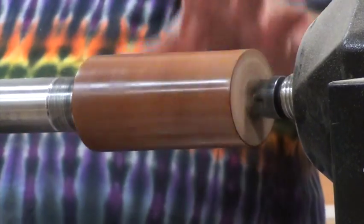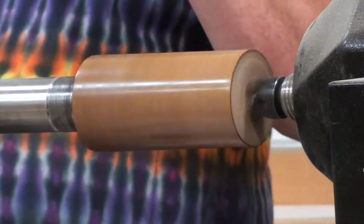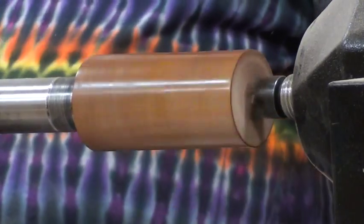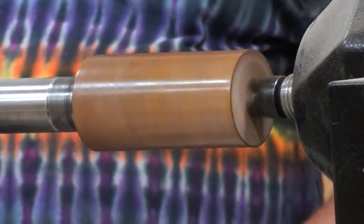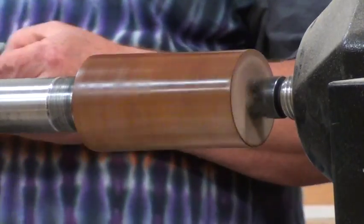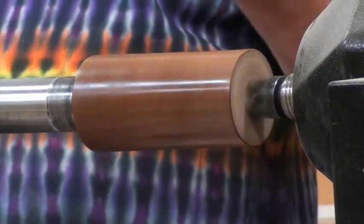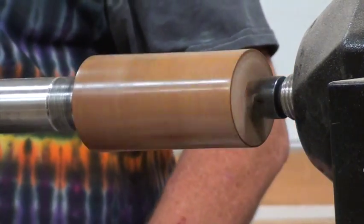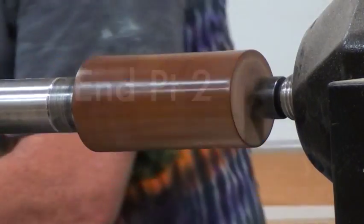The best thing after you do three of these layers: take it off and let it sit for two or three days. Let it completely gas off and harden. Then come back with the alcohol, soften it up, do another three layers. You wouldn't put sandpaper to it? No — you can take it right back down to the wood with alcohol. Shellac will just keep coming off and you don't have to use a lot of rags. One more layer.